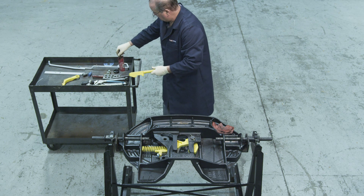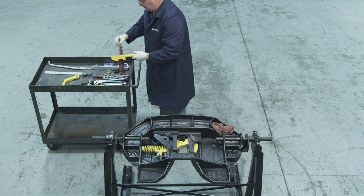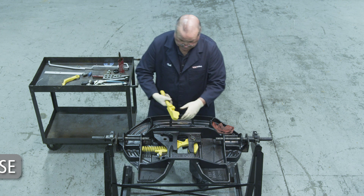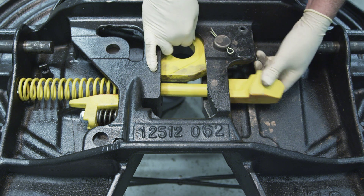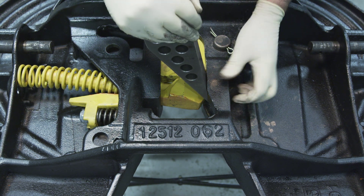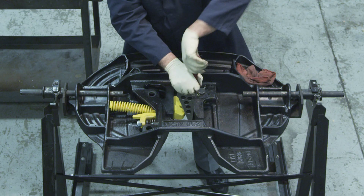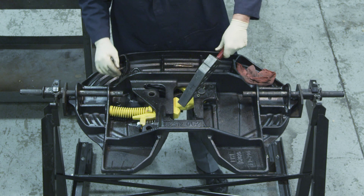Now that the adjustment wedge is installed and the plunger spring is in place, the plunger can be installed. Start by thoroughly lubricating the plunger including the pocket area with a light grease. Rotate and hold the lock in the closed position. Then slide the plunger through the opening on the right side of the throat of the casting, through the plunger spring, and through the hole in the rib of the casting. Using a helper block, compress the plunger until it is flush with the throat of the casting. As you compress the spring, make sure that the tail of the plunger remains in line with the hole in the casting.